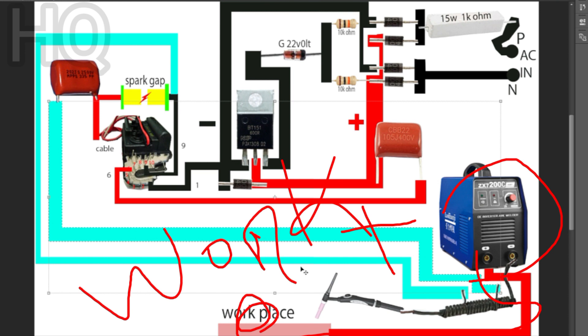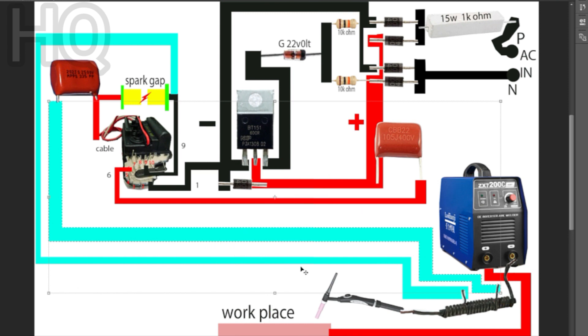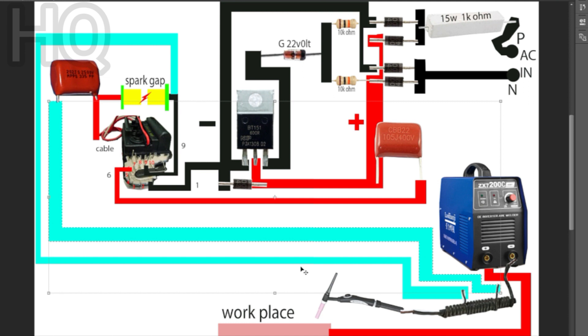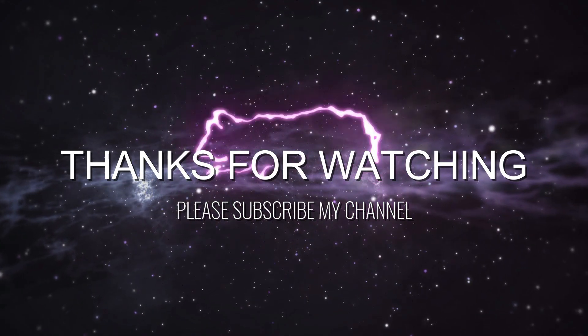The secondary of the simmer coil is directly connected — one side to the negative port of the welding machine and the positive side directly to the workpiece. The other side of the simmer coil connects to a contactor, which has a switch connected to the AC input section — the switch is used for AC on/off. You can use this schematic for making the circuit. It is very easy and I hope you understand it well. Please like the video, subscribe to the channel, and share with others. Thank you for watching!